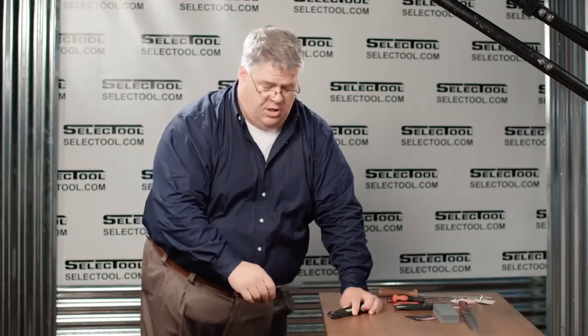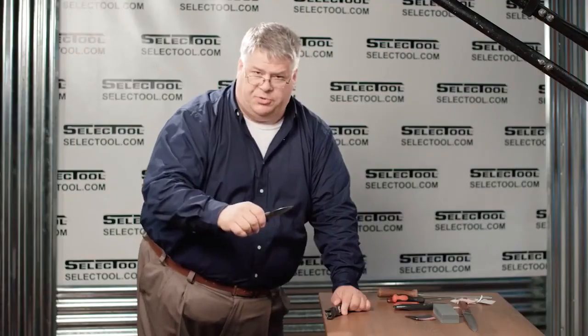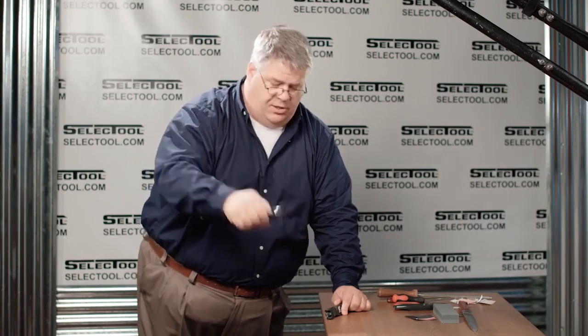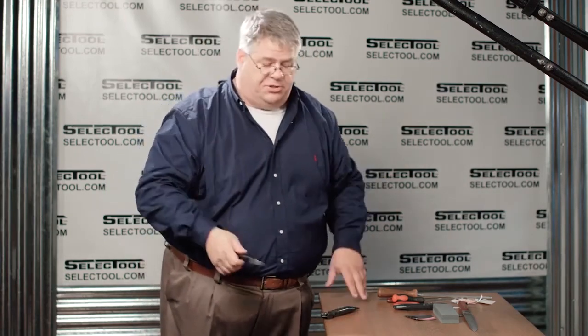Now after you use the knife a little bit, those little tiny microscopic teeth will start to bend and fold over. And what you want to do is straighten and get those tuned back up repeatedly over and over. So on the front here you'll shape, do that once, and then over here on the side, and just do this until you can't feel any more roughness. Do this repeatedly, okay? Shape once, straighten many, cut, use, come back in here, and that's the best way to get and keep a nice clean edge all the time.